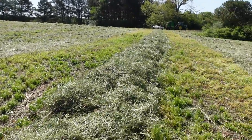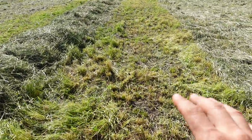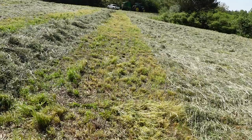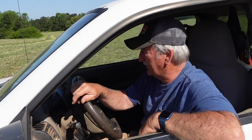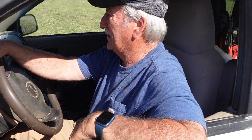Some of this — look guys — I'll show you one of the other fields where I got a real close, perfect cut. This cut is awful. We've had a conditioner for years and it was set at the factory and we never really adjusted that height. Now we've readjusted the height and it cuts like a lawnmower — common sense, just one of those things you've got to do. It looks great. We never have been able to roll like that with a V-Rake. It's great. How long have you been baling hay? How old am I? About 50 years?